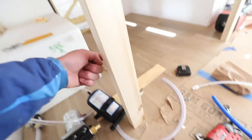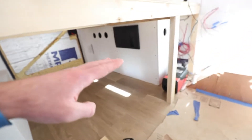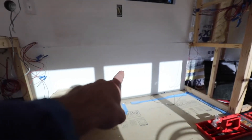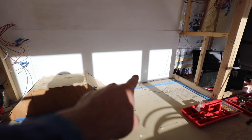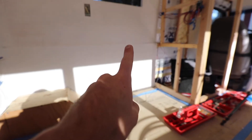From the accumulator tank we're going to go up on the back side of this, because here is going to be a big drawer holding my fridge. We go right over the fridge all the way to that corner, then along the back wall behind the oven and behind the drawers. In this wall is where my water heater is going to be — cold will drop down into the bottom of the water heater, hot will come out the bottom and go back up. Right here is where the sink is going to be, with a three-way split: one for hot, one for cold, and one for filtered water where I'm going to put a water filter on the wall.